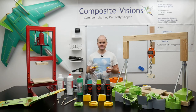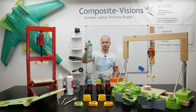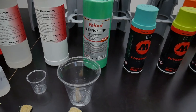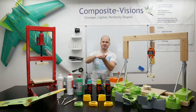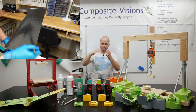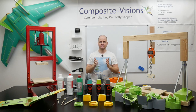This first tension test makes us very optimistic. We just covered these lightweight PLA stripes with resin. The resin was thinned with spiritus — we put 10% spiritus to the resin and hardener mixture so that it became liquid like water. That's very important to impregnate the surface really deep down, so it doesn't stay on the upper surface of our lightweight print. It should go between the layers and the small holes so it can bond them extra strong.